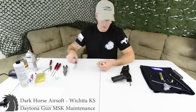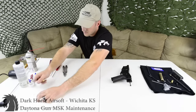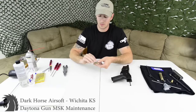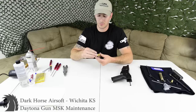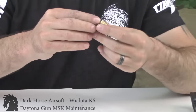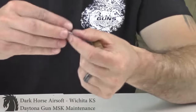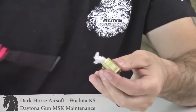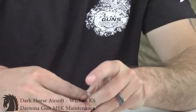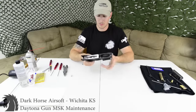I'm going to wipe down the valve and the line — there's not much to do to the line. The valve has two O-rings on the inside. When running a cleaning patch through any of these holes, make sure you actually get it all the way out so you don't have paper remnants left behind. Paper towels are a little thicker and don't tend to rip nearly as easy. Run one pass, then throw another one through — the first one came out a little dirty.